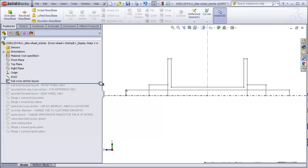If I roll forward one step, we'll see that area of the hub shell in this added-on sketch, which covers over this bearing and spacer area. These two sketches together represent the axle passing through the hub, the flanges, the shell covering the axle area, and the portion of the shell that covers the bearings. It also includes the spacers and lock nuts that we are going to make a simplified representation of.